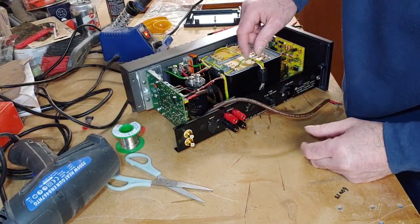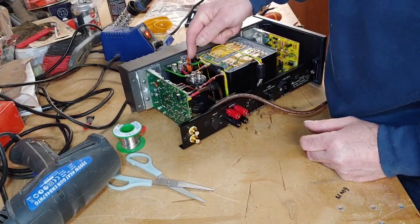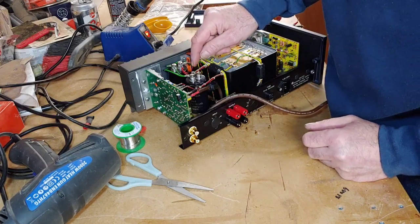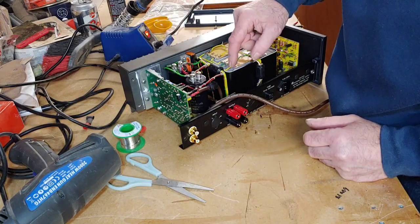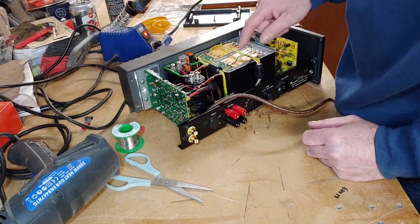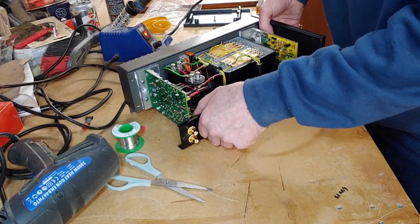But what I want to do is also upgrade all this internal wiring here. I want to upgrade it to some silver plated Ohno continuous cast copper wire, which I'm going to buy in, which is Teflon insulated, because all this is just PVC, you see. And this wire is the original wire from 1981. I mean, these little amplifiers are still superb considering they were built back then.